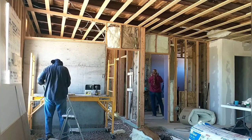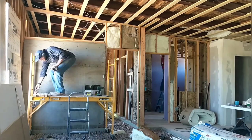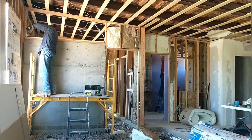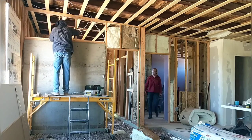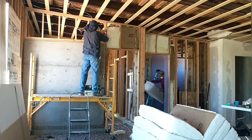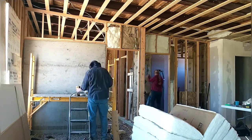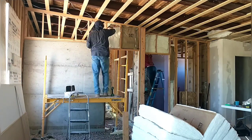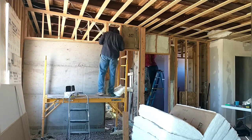I'm moving on to installing the framing above this concrete wall and wanted to do something a little special here. The wood along the bottom, top, and sides I want to remain permanently exposed — not covered in drywall — but I want drywall blocking the opening above the concrete wall. So the framing I put in is inset a half an inch on either side so the drywall will be flush with the face of the wood, leaving the wood exposed.